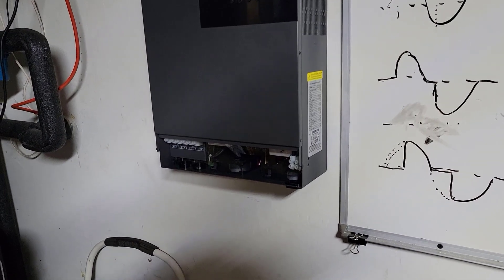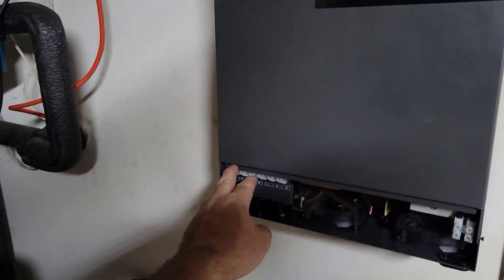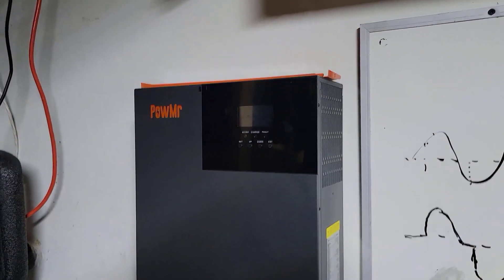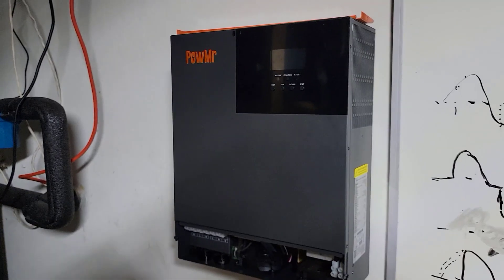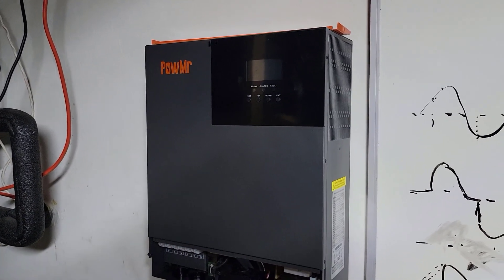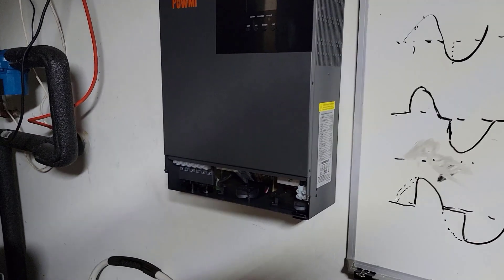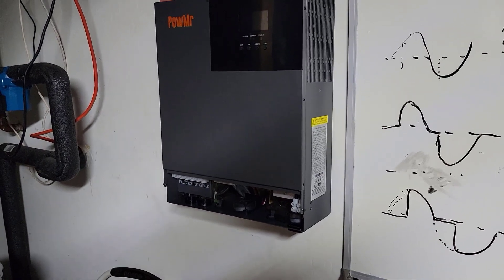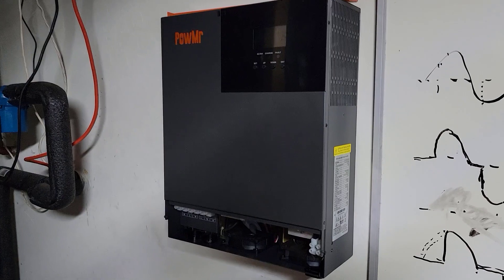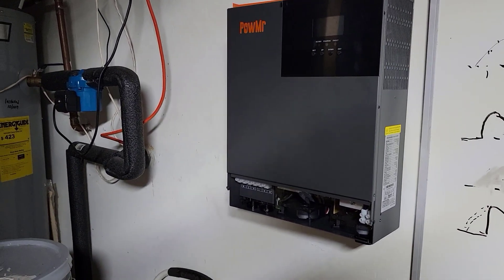The battery connection is 48 volts, which is very typical and nominal, and it's got these huge lugs in there for that. It's just got the 120 volt input and output — just an Amazon special. It can be configured the way I want it. You could set it up as a UPS, using utility power as priority to keep the batteries charged, or run it the way I'd do it where it only charges batteries when you have sun, just for battery backup purposes.